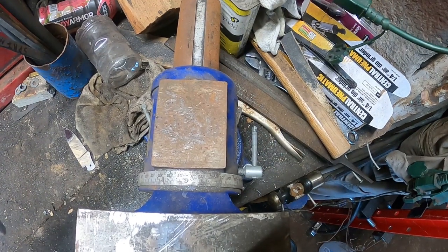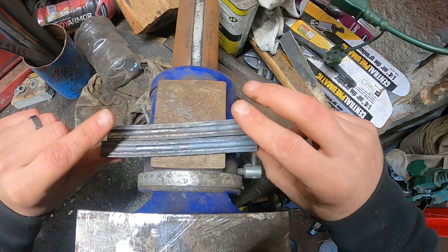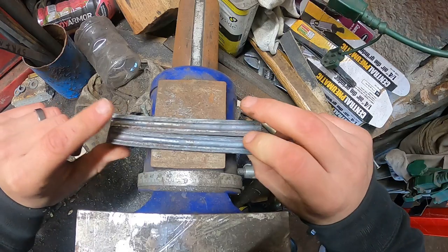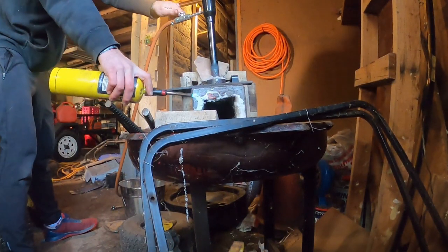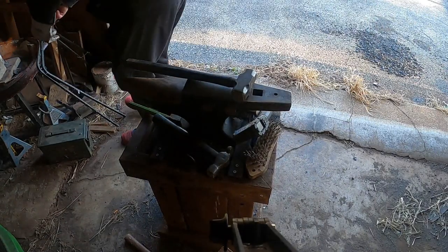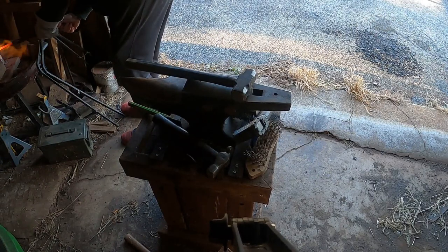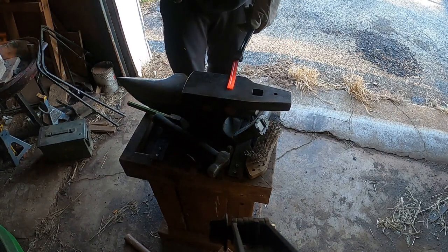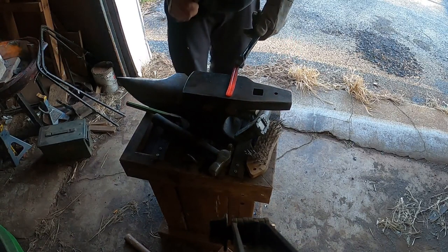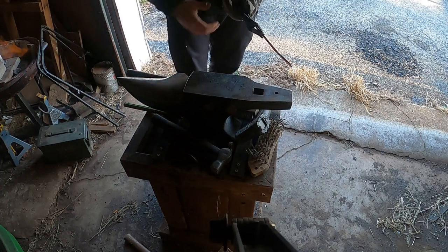All right, I'm going to get the forge fired up. We'll get these thrown in, flattened out, and then we will begin shaping it into that little knife edge. All right, let's get to it. So what we're doing here is taking the outer race out of the forge, now that it's nice and warm, putting it onto the flat of the anvil and striking it with the rounded side of our hammer to spread it out so that we get a nice flat surface to work with.